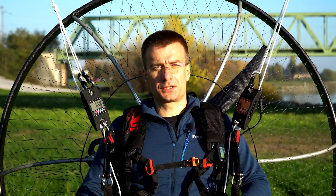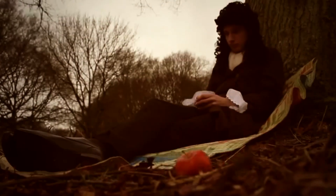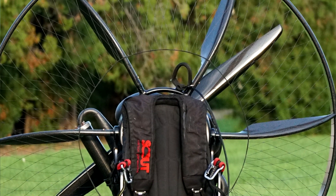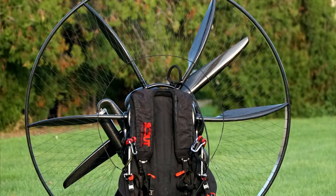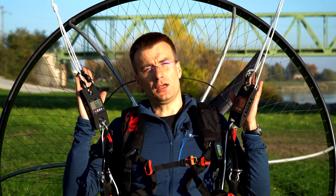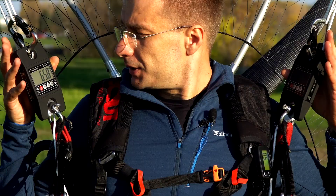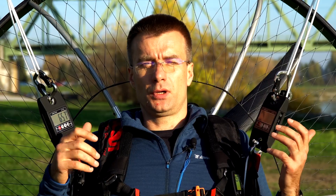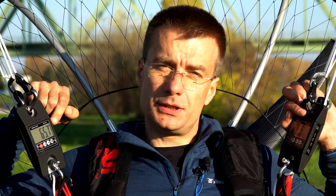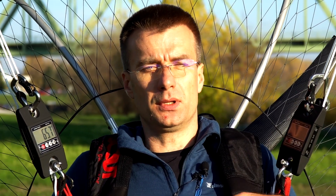At the end of the video, you will find out why my measurement 10 years ago was wrong. Just like Sir Isaac Newton, it all started with a tree. 10 years ago, when I did my measurements, I just found a tree, suspended the paramotor from it, and put these kind of scales. It basically showed 66 on both. When I applied throttle, the torque would have a tendency to twist me to the right, so I would see weight increasing on one scale and decreasing on the other. The difference is actually the torque — super simple.